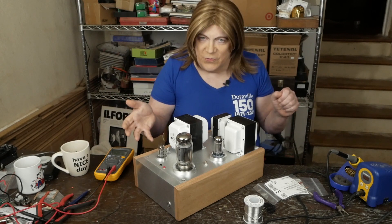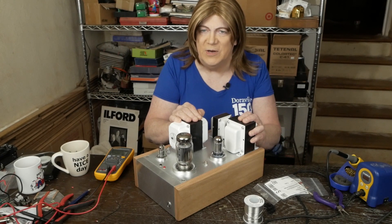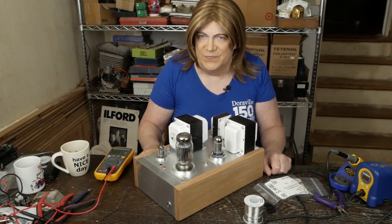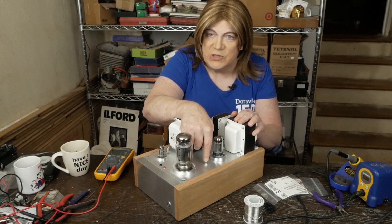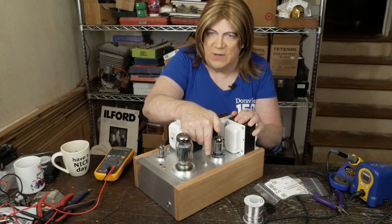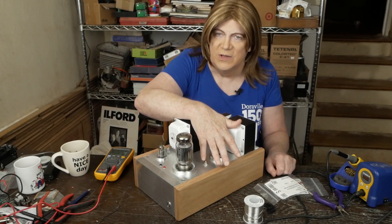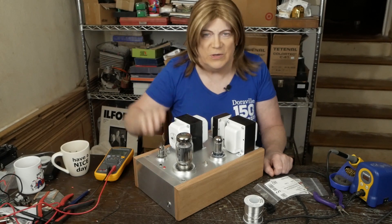I know the R300 got put on the back burner a little bit, because what I love doing is building stuff like this from scratch and coming up with my own cool designs. You just don't see single-ended KT120 amplifiers for sale or even designs out there, so I thought this was going to be a really cool thing. Being a fixed bias design, this thing should be able to adjust to run KT88s, and by changing the rectifier tube to one with a higher voltage drop, we should also be able to get it to run EL34 tubes. So you could have it set up with EL34 tubes and a 5U4 rectifier for jazz, and then when you want to rock and roll, pop the KT120 in with a 5AR4 and crank up the bias and let it rip.